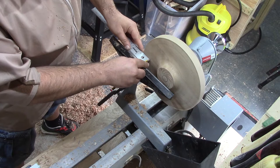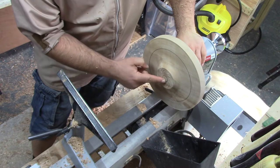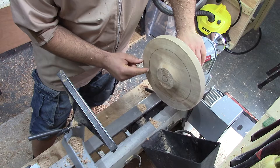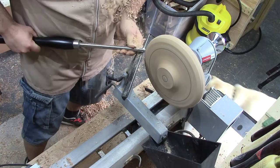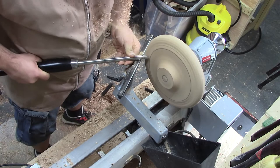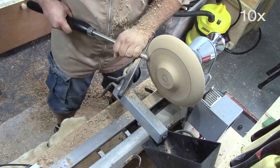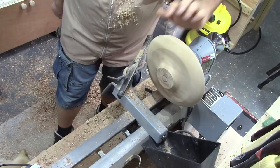Hopefully you'll be able to see that this circle here is the area I want to be the start of the radius on the dome. That's going to come down and follow down through into that line. We've already started the profiling but I just need to accentuate that more, and now I've got this line back on I can start to round this off - it's going to go all the way to the back, completely radiused on the outside.